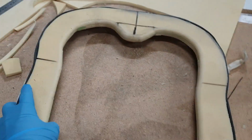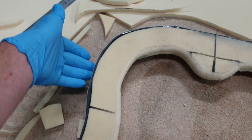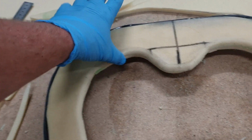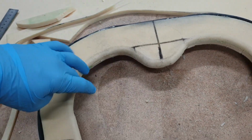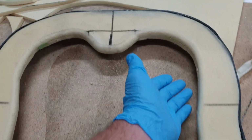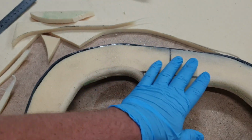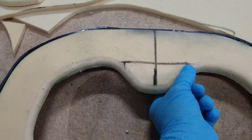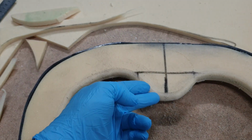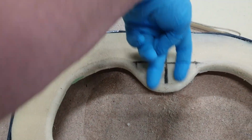This is going to be a little bit of a tricky layup, because obviously you've got to lay it on without compromising the outside shape, and we've got to be able to get it around the edges and still make sure that it's nice and solid around this corner, because all these little curves and little hangovers and things like that will give it more strength. Then we're going to lay a couple of extra layers over here and just cut it straight through and allow the hub to move up and down through here in this range.